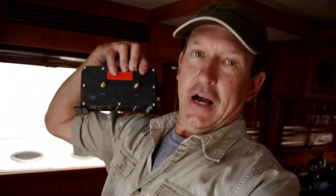On this particular boat, we replaced the galvanic isolator because it was not a fail-safe unit. When we replaced it, this older unit was not fail safe — there's even a sticker on the side that says not compliant with ABYC A28 as of July 2003. So it's an older unit and we swapped it out. Now we want to test the new one. We'll show you how to test a galvanic isolator while it's on board the boat — very simple, and very much like what we did back at the shop.